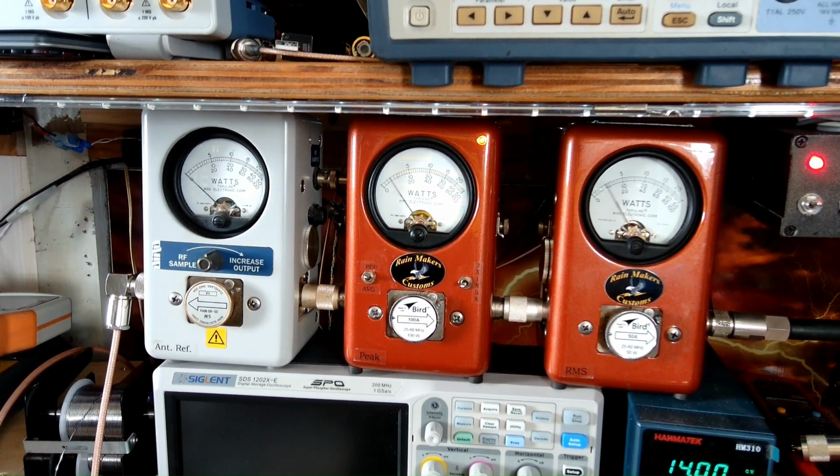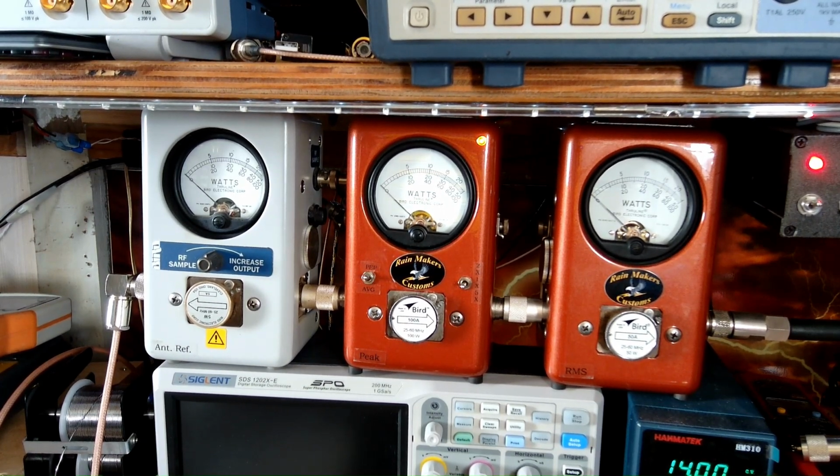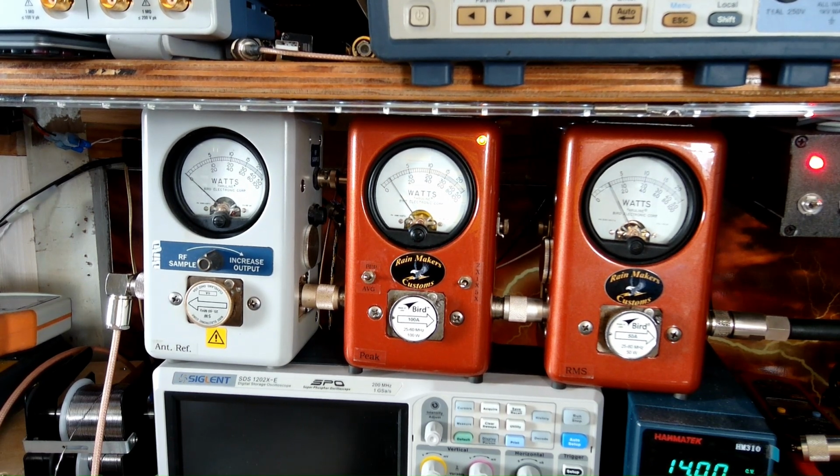Let's go ahead and roll this up a little bit more. Dead key about 5 watts there. Worldwide audio. So you're going to see about 30 on the top end. Granted, if you go all the way up to the 9 watts, it will do about 38 on the RMS. That's at wide open. So plenty of RMS is available here, but for general talking, your 3 to 5 is going to be a good spot. If you wanted to, you could go at about 8 here. Audio. And you're going to see about 35.